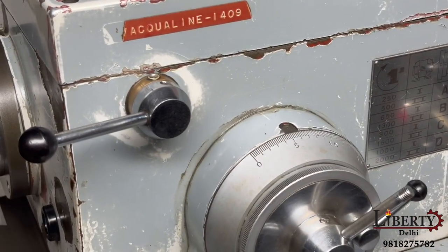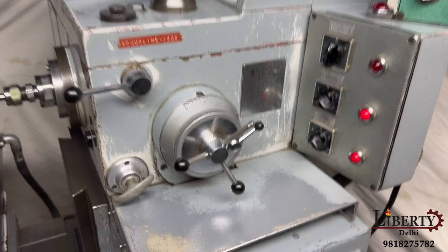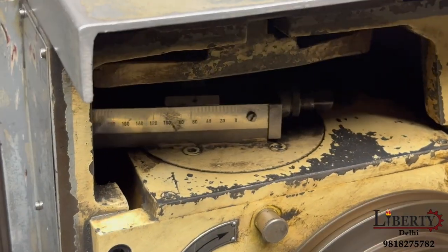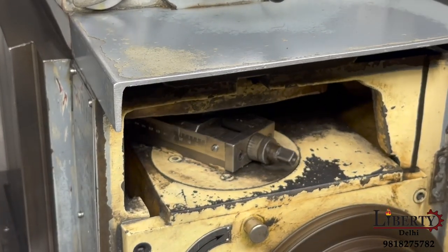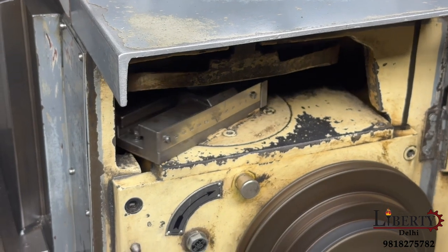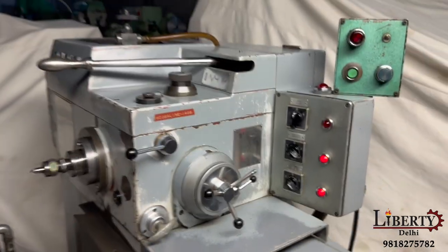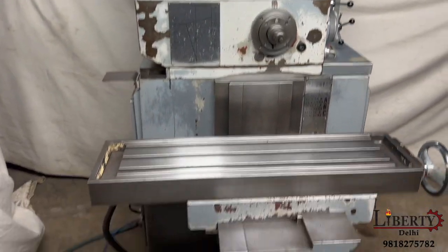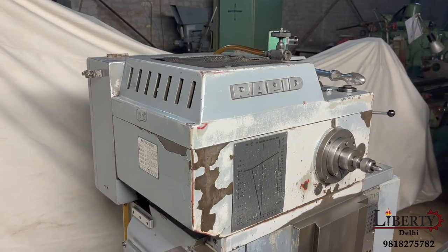The arbor bar may have cut at a depth of keyway and may increase the maximum length of keyway. In this machine the maximum length of keyway is 200mm. With the cam key setting, we can see or set the length of keyway. I am going to start it.